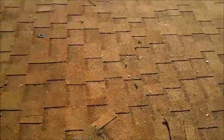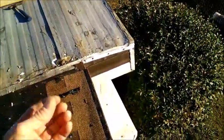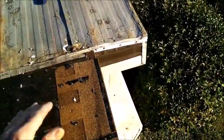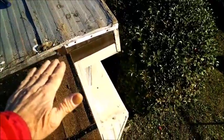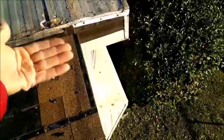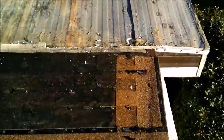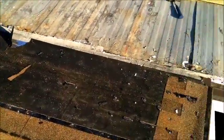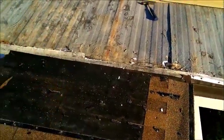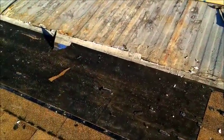The best way, in my opinion, is there's a gutter that runs around the house normally. You can build your porch a little bit lower than the gutter, and then slide a piece of metal up underneath that piece of gutter and down to use it for a counter flashing on your last row of shingles. And I think that would work. That's about the only way. Very difficult to line one up with the trailer and stop the water. Anyways, just a little word of advice.